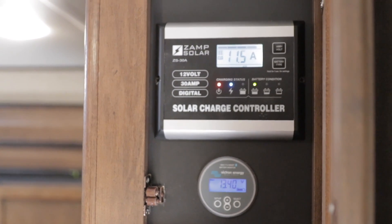Next in that solar kit was the charge controller. It's a decent charge controller and it's going to do the job well. I liked that you were able to input which kind of batteries you had — if it was lead acid or AGM, or if you had lithium — we were able to configure that in the settings, which I really appreciated. One thing that surprised me about this charge controller is it had four stages for charging: bulk, absorption, float, and it even had the equalize function. In their situation, they won't need that equalize function, but it's nice that it's there for other applications.